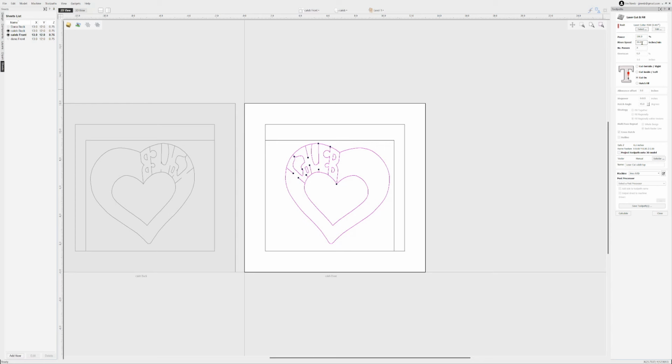So it's not better if you were to really overkill it and cut 90% of the way through from both sides. You'll just get more charring and stuff. So you really don't want to overdo it. The idea is to go as fast as you can and probably do a couple of passes on each side versus blasting it as deep as you can, going really slow. As I showed in one of my other cutting videos, you get cleaner results that way.